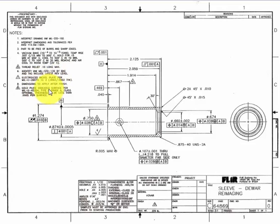Now note 8 says dimensions apply after finish. That means that even though dimensions and tolerances are given on the print, consideration must be taken when machining the part so the tolerances are not exceeded after plating. So if you go over here and look at this external diameter and go back to note 7, it says 1/10 to 2/10 thousandths thick. That's per surface. So on this diameter, you could actually change that diameter 4/10 thousandths with the plating and exceed that tolerance.